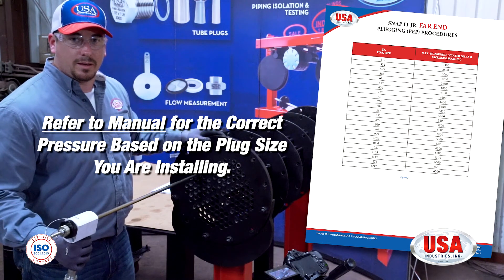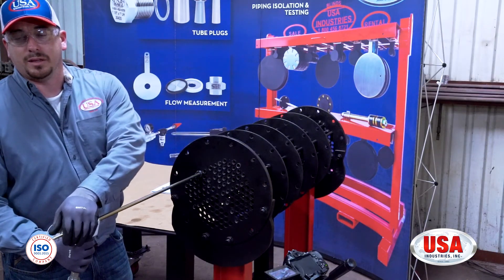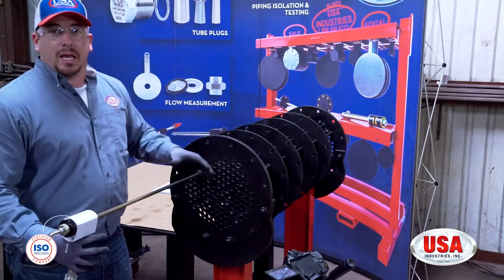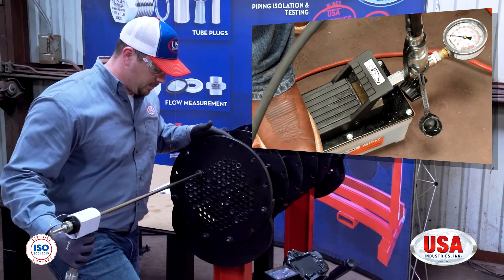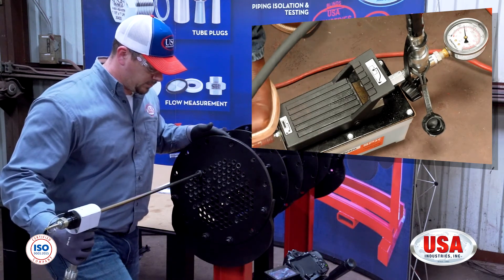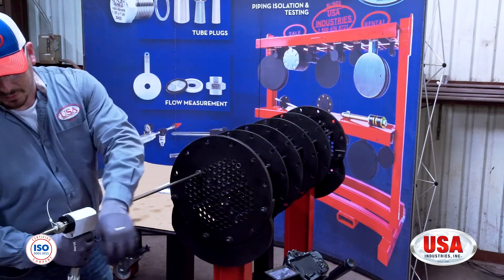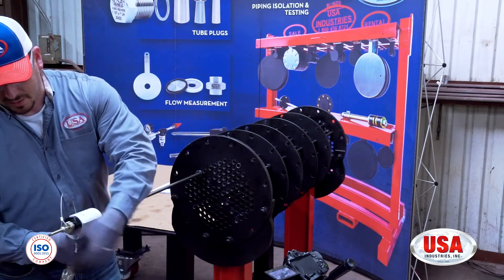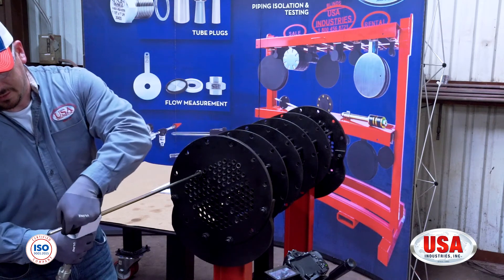From there, we are going to decompress it, then run it up a second time. After you have tightened everything down, there will be some slack — you will tighten it down with the expansion nut. You want to make sure that your hands are out of the way of the safety cable, and no one is behind you or near you while you are installing this plug. I just ran it up to 3,000 PSI, and I am going to tighten everything down with the expansion nut. After it is tightened down, you are going to tighten your safety cable back down where it touches the expansion nut.